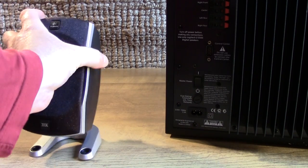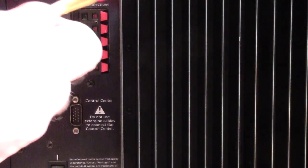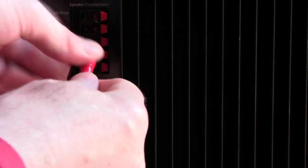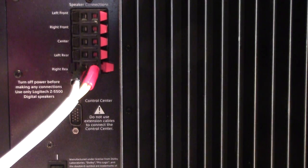One of the things I would say with any sort of speaker setup - do yourself a favour and get some proper banana plugs or speaker pins or whatever kind of connector you use. Connect them well to the wire. It just makes life so much easier if you've got good connections on your equipment. I have the wire with the speaker pins fitted and it can easily be put into the spring clips on the back of the speakers and here on the back of the amplifier. It fits nicely in place. There's no fraying, there's no possibility of any sort of shorting or anything like that.